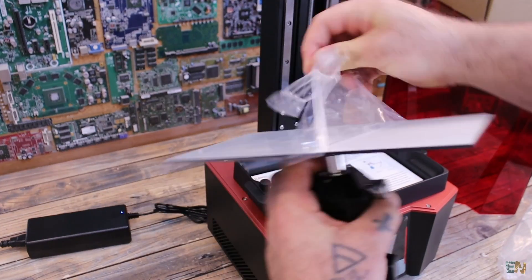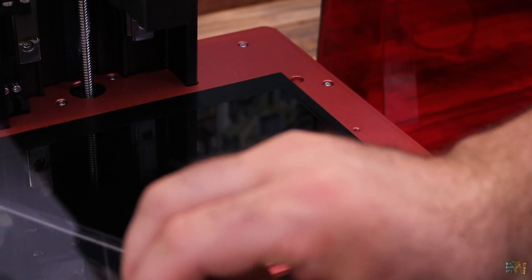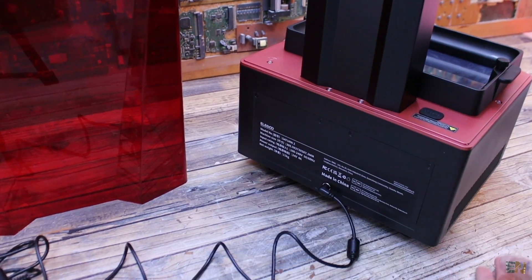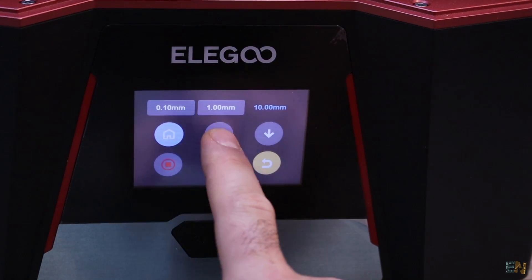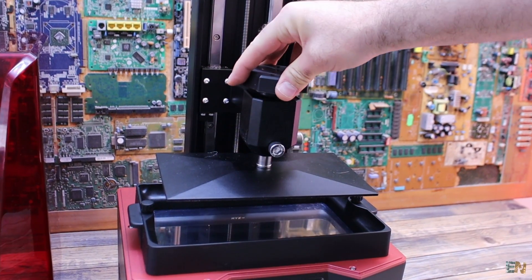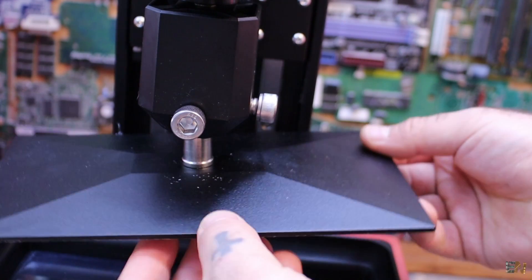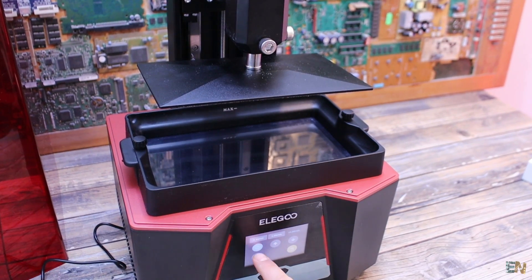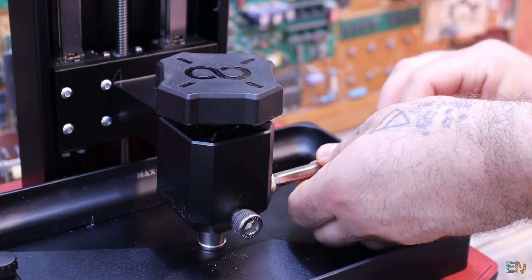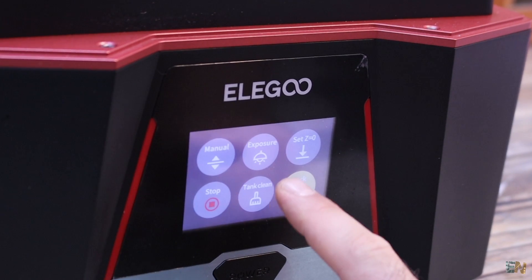So we are ready for some tests. I take the film protector from the printing bed but also from the resin vat. We put back the vat and let's home the machine. Connect power to the printer and use the main switch to turn it on. Go to the menu and lift the Z axis. Then we place the printing bed over and tie the top knob. We use the allen key to loosen the screws holding the bed. Make sure it can move freely and then go in the menu and click the home button. Now the machine will go to the zero position. At this point we tie back those screws.